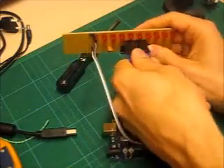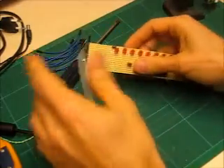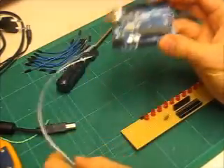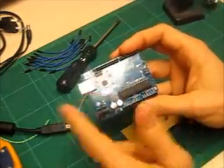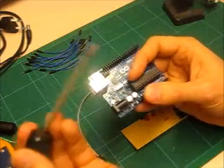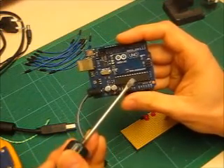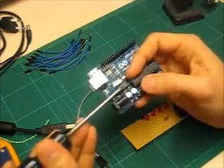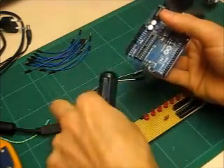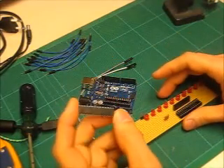What I'm going to show now is how to make this really bare-board Arduino. We begin by unplugging the power and setting that aside for the moment. You begin by uploading the sketch you want with the platform — I hope I don't have to show you how to do that, if you know Arduino you've done it. Once the Arduino code is on the chip you can remove the chip carefully. So here's the Cylon scanner code on this chip.